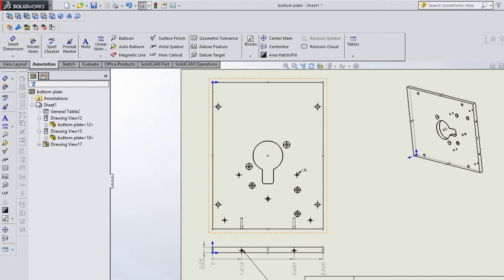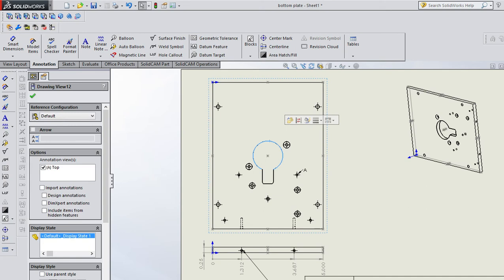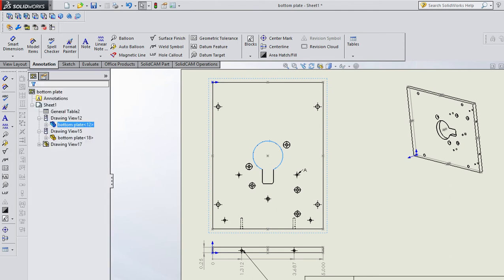For this example, in order for a machinist to do this properly, without the computerized file, he would have to know the diameter of that circle, he'd have to know the center position of that circle, and he'd have to know all these distances here and these fillets. Okay? You could do that. It's going to make it a little more busy, but you could do that.